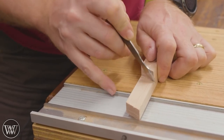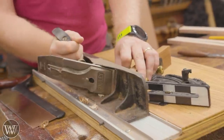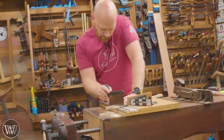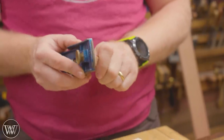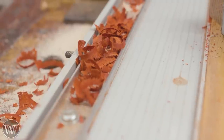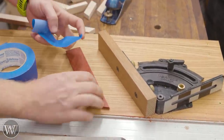Now I want to cut pieces and I don't know exactly how long I want them, so I'm just going to make something about this long and cut two of them so I can play with them and see how they go. Then I can shoot those little pieces and make sure the other side is the exact same length. I'll use one of them to mark out the other and cut it down. I realized the length is good — I'm actually going to leave them a little longer so there'll be a hole in the middle. The key is I need all of these pieces to be precisely the same length, so we need to make a stop so we can shoot them all to exactly the same length.